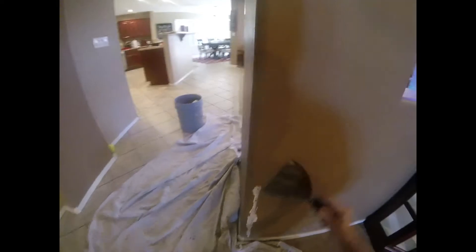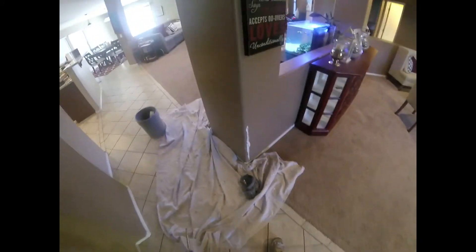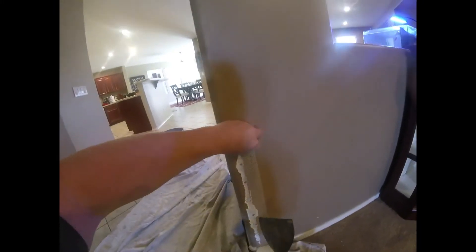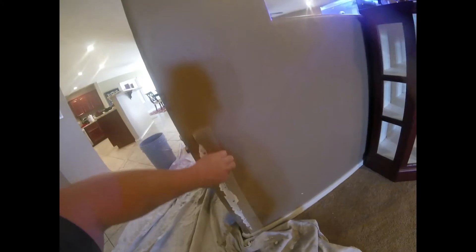When I get this all ready to go, I like to always follow through with a fiberglass mesh tape. You don't necessarily have to use fiberglass tape, but if we're going to go through this much work, we want to put a fiberglass tape so it never cracks out again. This will be a strong repair. Just put the fiberglass tape over — you don't want to go past the edge of the corner bead, because we want to coat it. We don't want it sticking out past the corner.